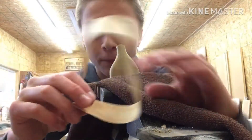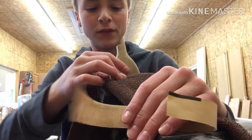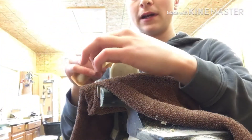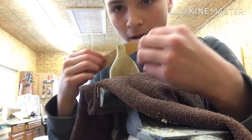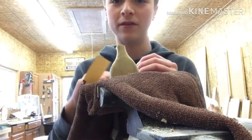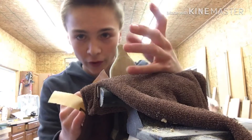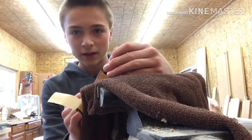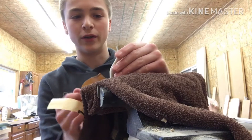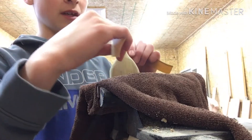What I'm using here is a little bit higher grit sandpaper. I'm just putting this in the vise and I cut a little strip off, and that way you can work your way around it, curl it, and get it nice and rounded. I found that's what works best for this. Preferably if you have a belt sander that works best to start, but I think this is definitely a good finish to keep it round.